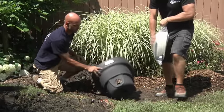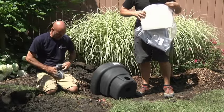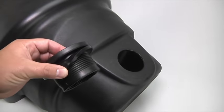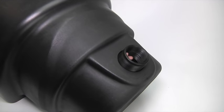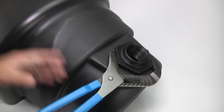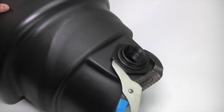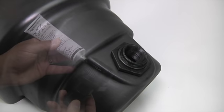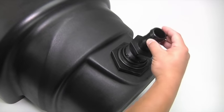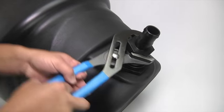Prepare the biofalls prior to installation by installing the bulkhead fitting provided through the hole found at the back of the filter. Unscrew the bulkhead and insert the threaded adapter with the rubber washer on the inside of the filter. Place the plastic washer and nut on the adapter and use a pair of channel lock pliers to tighten down the fitting, creating a watertight seal. A couple turns past hand tight should do the trick. The silicone provided in the kit should be used around the fitting threads when connecting the barbed pipe fitting to the bulkhead. This will assure you of no leaks in the plumbing connections.